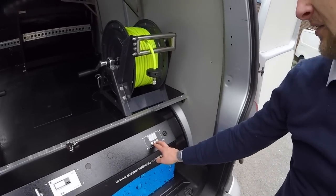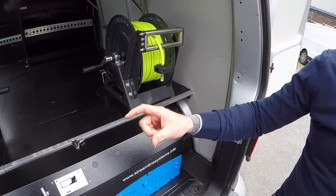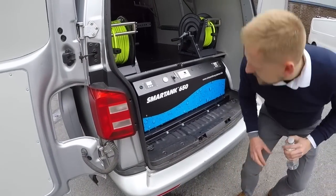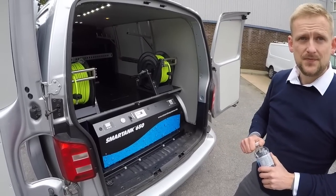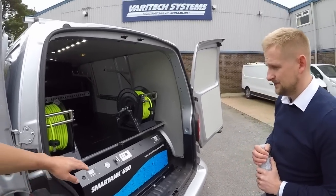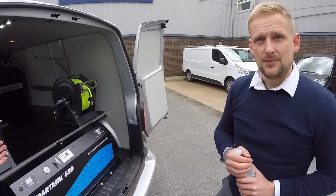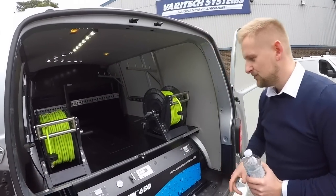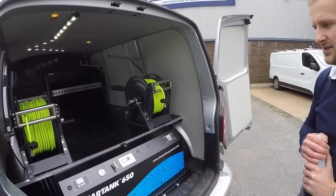On the up and down arrow for three or four seconds, that sets it to fill mode. That lets the solenoid know it's on fill mode, which will open up the flow on this port. You can fill away and it will shut off automatically once the tank's full - it's an electronic shutoff, not done by a ball valve, so much more reliable. You need to fill it overnight: put the tap on, go to bed and forget about it, and in the morning it'll be done and ready to go.